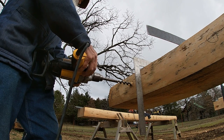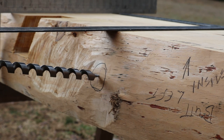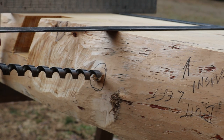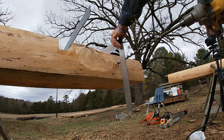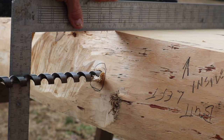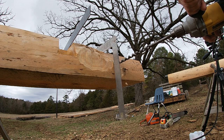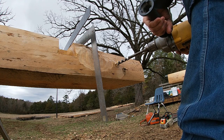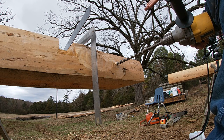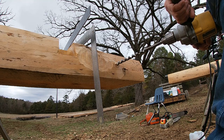I'm not going to try to drill all the way through — I'm going to back the bit out and do the same thing on the top side of the log. I've got my point in there, getting it started and sighting down the edge of the square so I know I'm running straight. I let the square back up and start drilling. I just felt it hit the other side, so I ease this in and out — if the other side was off just a little bit, pushing the bit back and forth all the way through helps straighten the hole out.